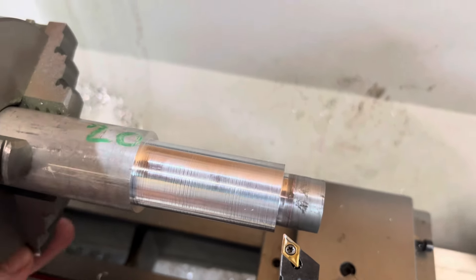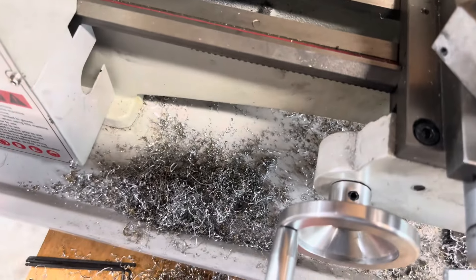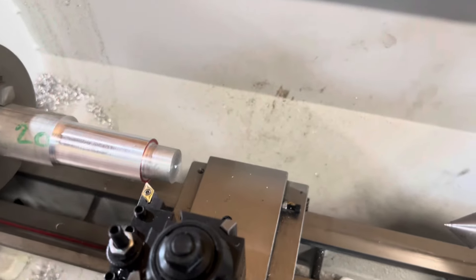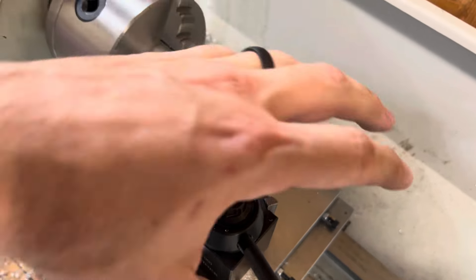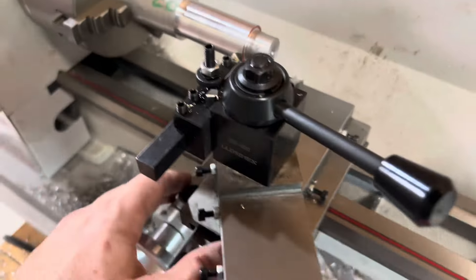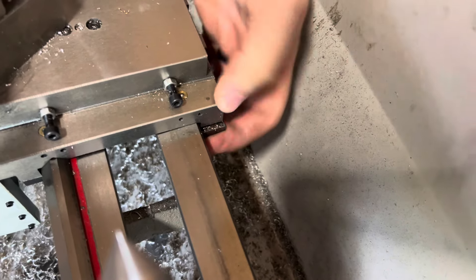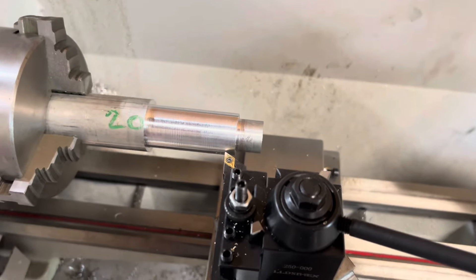So far it's not a bad finish. Not the best, but just for an initial rough cut it cuts pretty well. I already threw away a lot of chips. It cuts some chips but yeah, not too bad. I got this thing moving nice and smooth — it's not walking as bad as it used to. It used to kick side to side every time you turned it, which is why I took the screw for the power feed out so I could get a tighter tolerance on this saddle so it wouldn't walk side to side. You can see right here this piece that I made — nothing too crazy, it just fits pretty snug against here.